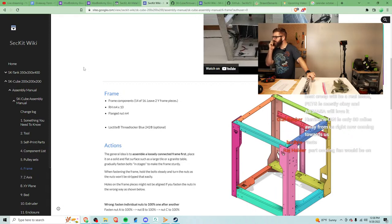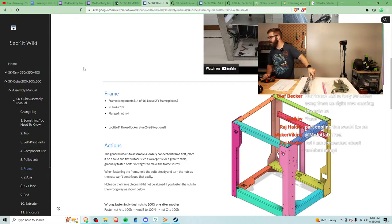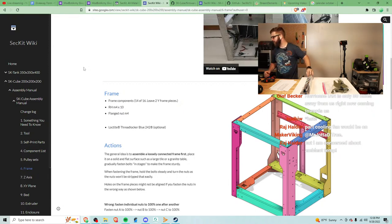That's a lot of the reason why when printing PLA, people tend to upgrade the airflow on their tool heads, because it needs to be hot when it comes out, but then it instantly wants to be cold. It probably won't be an issue if you're saying passive heating, but I certainly wouldn't want any active heating. And if you have your printer enclosed, and you're starting to see that overhangs aren't looking as nice, I would open it up to help with cooling it a little bit quicker.